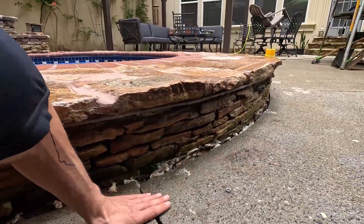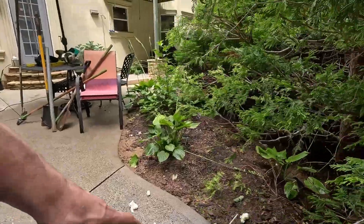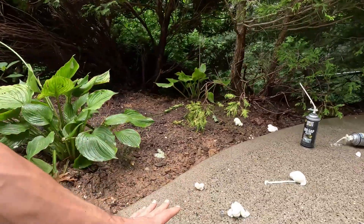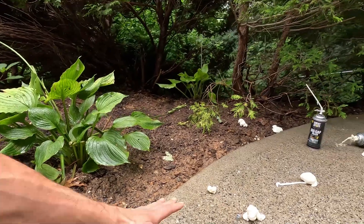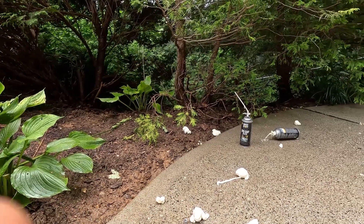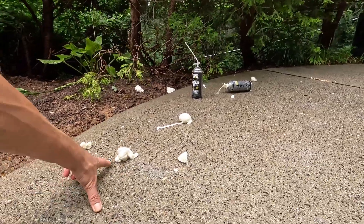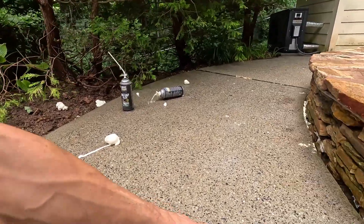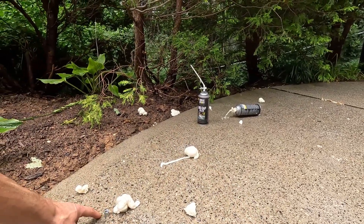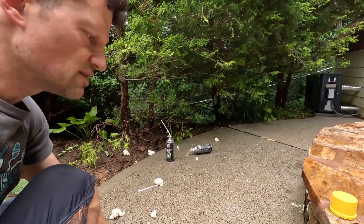This side is pretty good. I sprayed a tiny bit on the outer edge to either raise it because it's a little low, or at the very least to support it, since it sounded hollow. I banged down over the pipe and it didn't do anything for the height, but I think it's supported a little better now. All I have to do is grind off these anchors — I hammered one in — I think it's better to cut them off with a grinder, then fill the holes using the dust I saved for color matching.